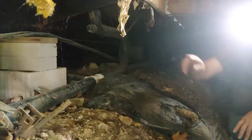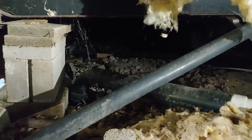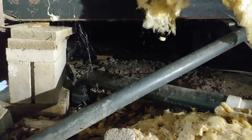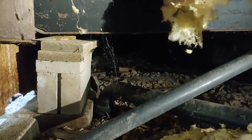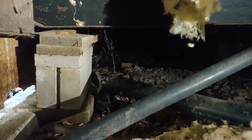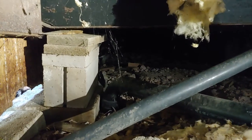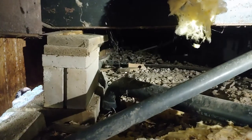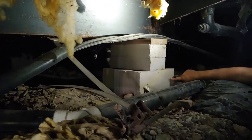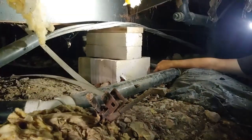The second thing I noticed: over there in the corner, that frame is not wedged up — there's an inch gap right there. That makes me think they probably set it there for looks and didn't really care, or maybe that sewer line is leaking right there and it's making it settle. But this one is carrying the weight, and guess what? That block right there is cracked — so it's not strong anymore.